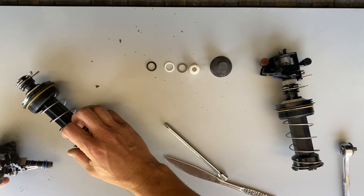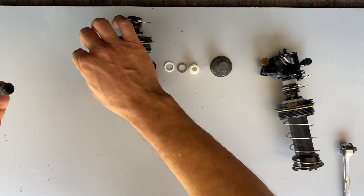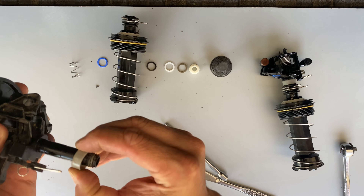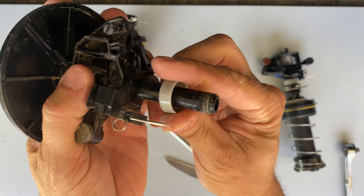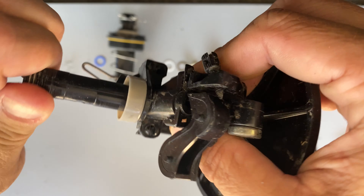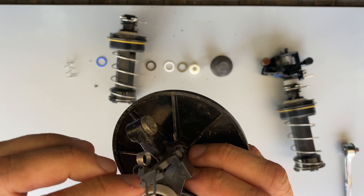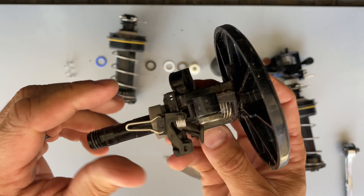May push some water through there. Here's the head — there's a blue washer, a spring, doesn't look like the orientation really matters. There's also this plastic housing or sleeve that just slides up and down on the neck, probably don't really have to take that off. We're on a well, so there's a lot of sand. I think sand just gets up in these heads or collects around here and keeps it from wanting to spin freely. I'm going to clean this all up, throw it back in and see what it does.